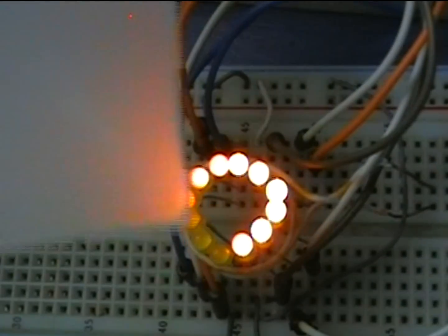As the LED pulses, it triggers the asynchronous edge-triggered RB0 INT interrupt of the PIC, and the interrupt routine sets a flag to spin the spindicator. This interrupt routine is very small and fast, thanks to the automatic context saving of the new PIC microcontrollers.